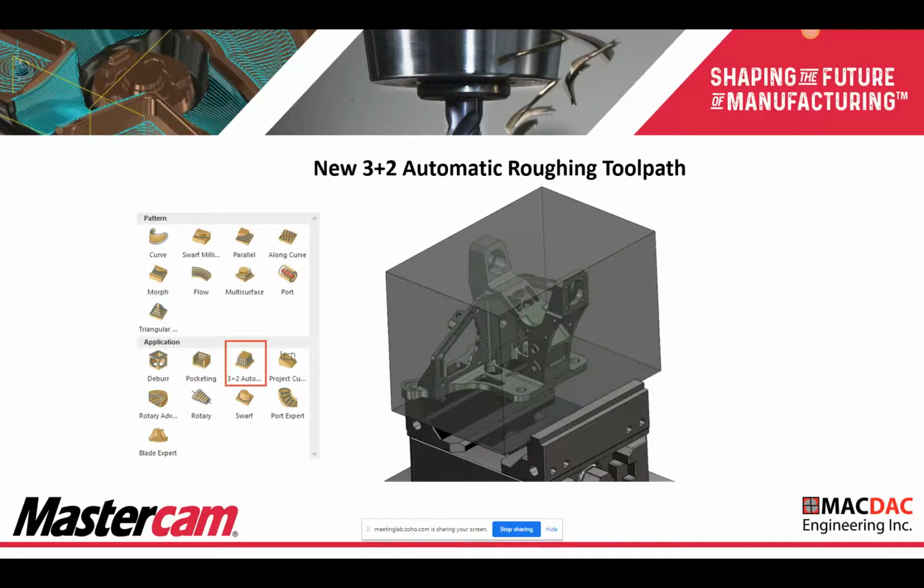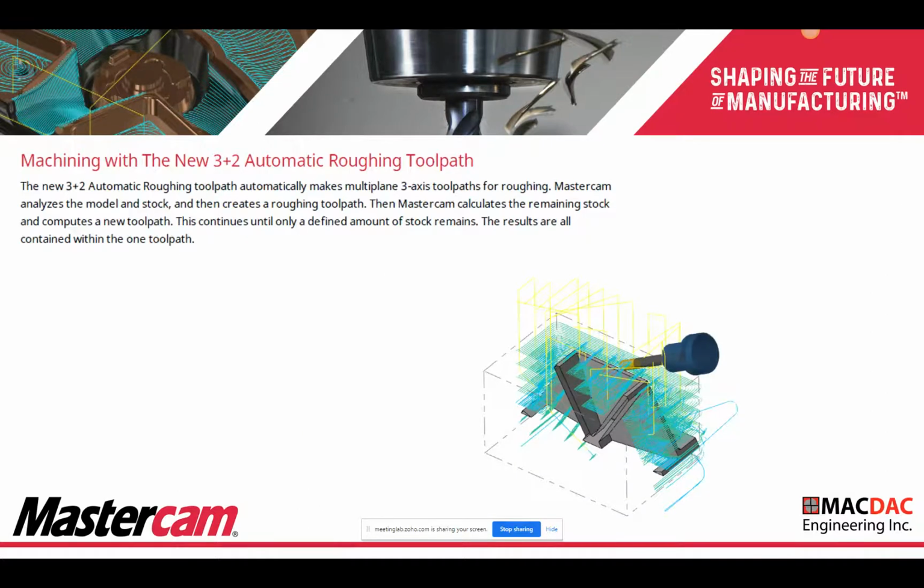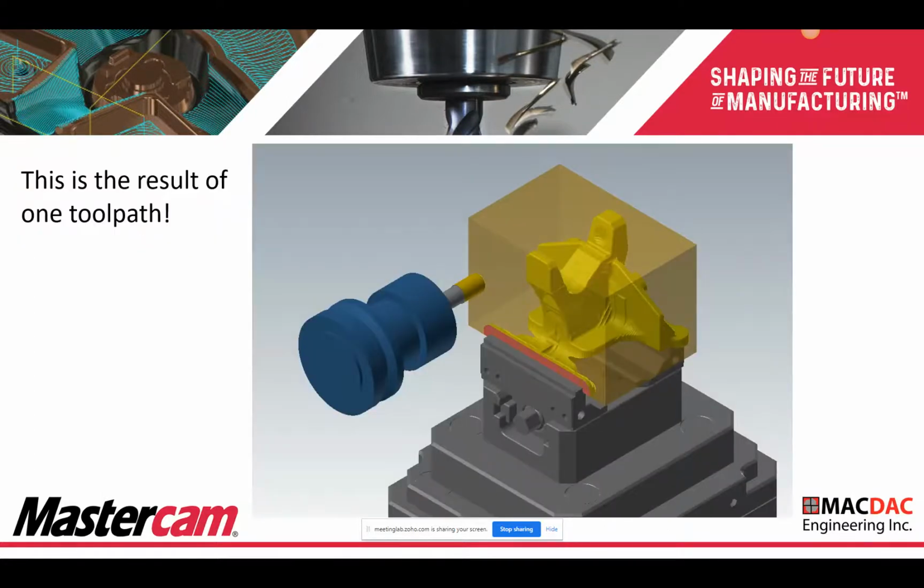All right, so this is pretty cool. A new toolpath for the Multiaxis called 3+2 automatic roughing. 3+2 automatic roughing automatically makes multi-plane 3-axis toolpaths for roughing. Mastercam analyzes the model and the stock and then creates a roughing toolpath. Then Mastercam calculates the remaining stock and computes a new toolpath. And this pretty much continues until the defined amount of stock remains. So the cool thing about it is that you can get a result like this in one toolpath.